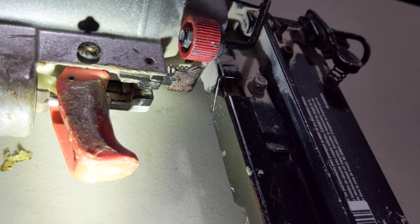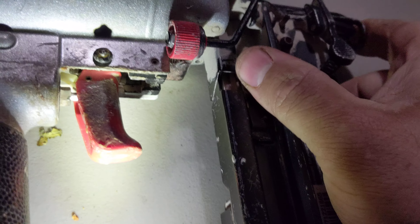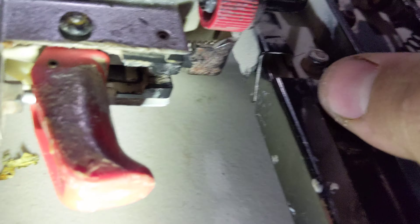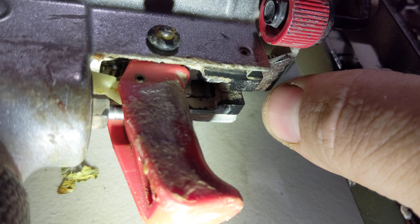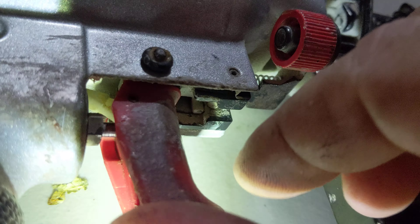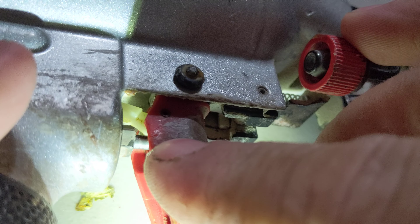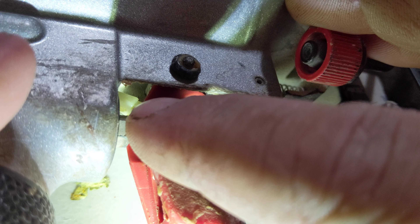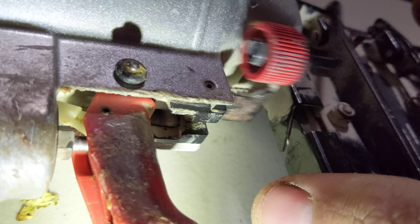So let's take it apart and see if we can fix it. Looking at how it works — when you push the tip stop, there is this adjustment here. I did try adjusting that all the way in and all the way out and it did not fix anything. So it has this linkage, this bar, a little nub down there, and it comes back here in the back of the trigger well. I also see this little piece of plastic that isn't doing anything. There's that middle nub for the solenoid which I assume fires the tool.